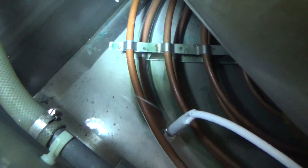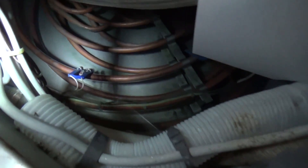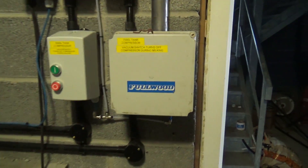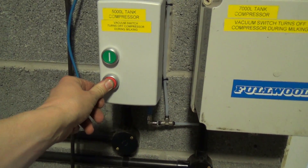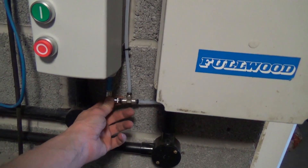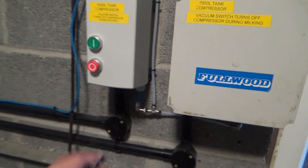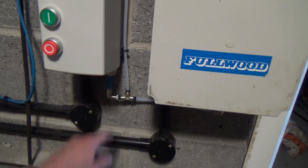It's making some noise. That's the contacts for the two units — that's the bigger one, that's the one we're working on. So that's if the overloads trip. You can tell they're wired right — they should stop when you press that. Lots of vacuum switches plumbed in to turn the units off when they're milking, but they're playing up at the moment. We'll have a look at that — I don't think they've got enough vacuum.